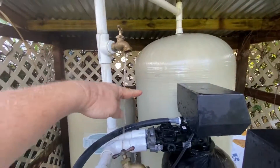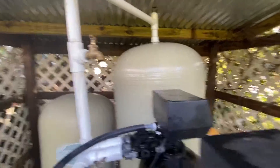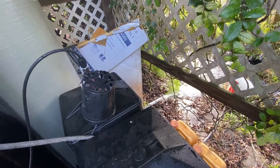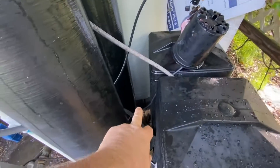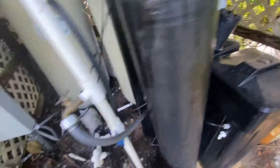Let that sit for about 10 to 15 minutes until the water stops flowing. You can see this one's going to stop because the water is low enough now — the tank's just draining at this point. I'm going to let it drain completely, flushing out 100% of the tank. Then once the water completely stops, I'll close that valve.